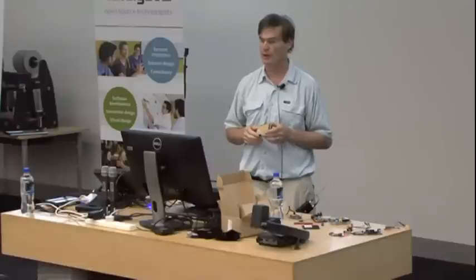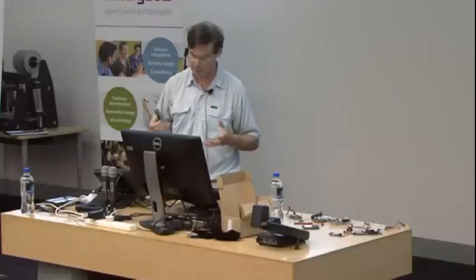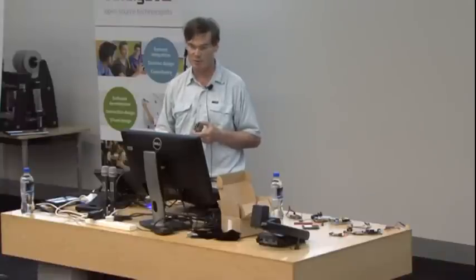It works beautifully. And it meant that it was extremely simple, on each autopilot board, to support all of the different RC input systems. It also avoids the need of multiple UARTs. One of the things that is scarce in microcontrollers tends to be UARTs. You run out of UARTs, and they're really valuable.